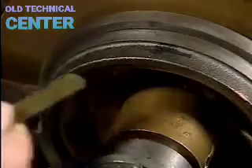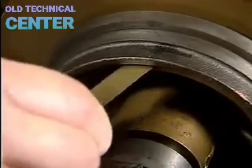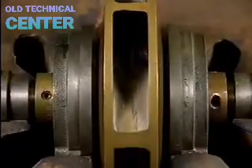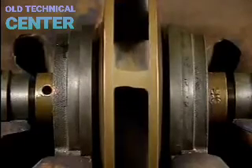The clearance between the impeller and the wearing ring is quite tight, but they should not be in contact during rotation. Wearing rings are designed to wear, and they are less expensive to replace than the impeller.